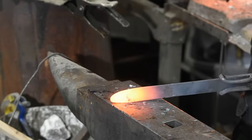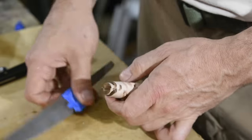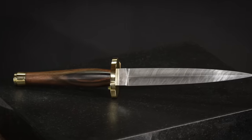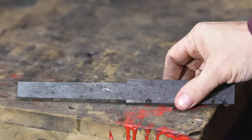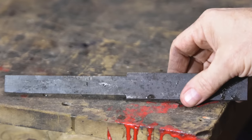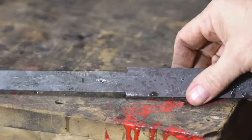Next, we're going to turn to handle types that are typically — but not always — used on forged knives. All the rest of these handles are going to be put on this little dummy setup here — it doesn't even have a blade. It's just a steel bar that's a stand-in for a real blade so you can see how it all works. Most forged knives have some variant of a hidden tang, meaning that the tang of the knife is completely encased within the handle. We're using this dummy tang to demonstrate several variants — it has notches milled in to demarcate the tang and separate it from the blade area.